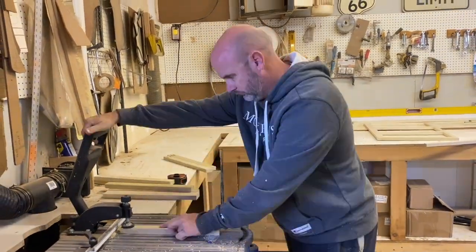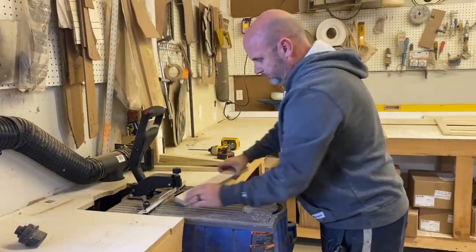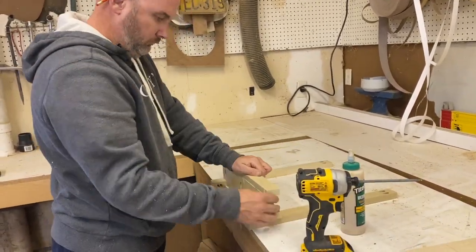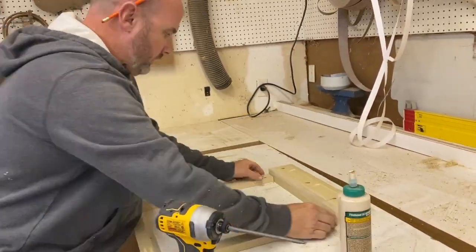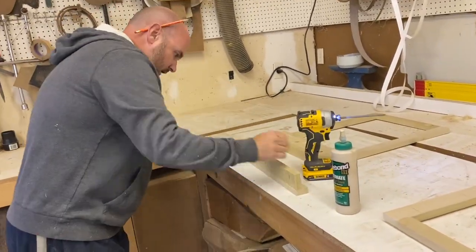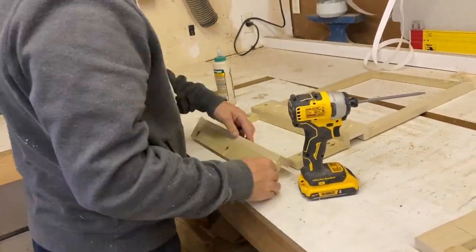Okay, so basically these recesses, while they're gonna give me the coolest look possible, they just created a lot more effort. The lower portion went together normally, but then to put those channels, it's just a lot more screws, a lot more time, a lot more pocket holes in general to prepare. However, a lot of the high-end Italian cabinets and Italian kitchens that you're seeing now use an extruded aluminum piece, and I really feel like this is probably stronger than that version, and also a lot less expensive than trying to integrate extrusions and everything into an otherwise wooden cabinet. So I think this is going to end up being a really, really positive way of getting that exact same look and giving me a really cool place to hide an LED light.